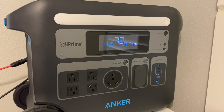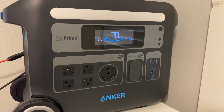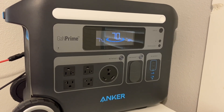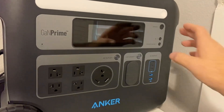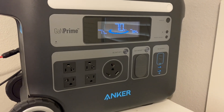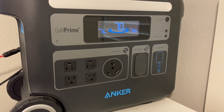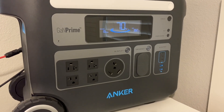Throw on an expansion battery and you're going to get about eight hours of run time with that 5,000 BTU air conditioner. I had a very similar system — same watt-hours — and at night I ran it eight hours with no problems. At night it's not pulling 450 watts the whole time because the compressor cycles on and off. But today, with the heat, that compressor ran constantly the whole time. So without solar you're looking at about four to four and a half hours; with the expansion battery, eight to nine hours, even during the heat of the day.